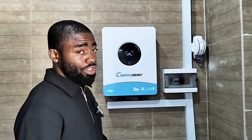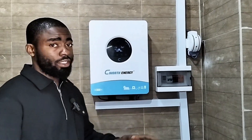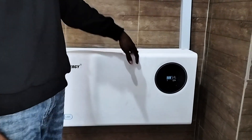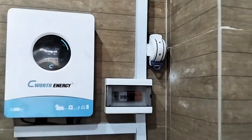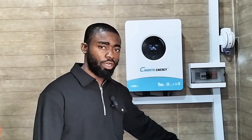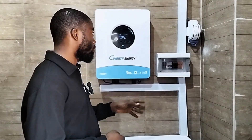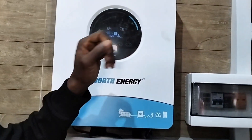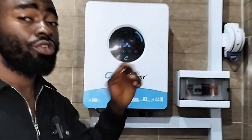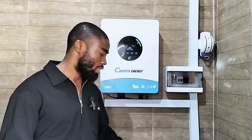The system comprises 8 units of 600 watt solar panels, one unit of 6 kilowatt inverter, and one unit of 10 kilowatt hour 48 volt lithium battery. With all the accessories, everything inclusive, it will cost you about 4.2 million Naira. The AC is actually 2.5 horsepower because when it was on, the load rose to about 2,600 watts, meaning the AC is drawing more than 1,500 watts and will not be suitable to run continuously on the inverter.